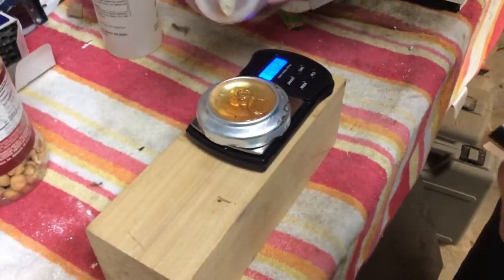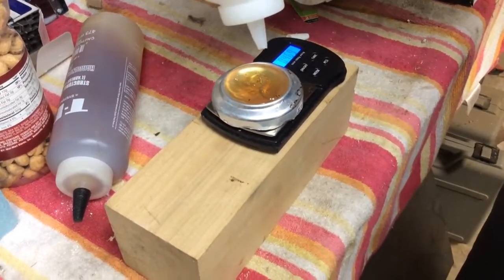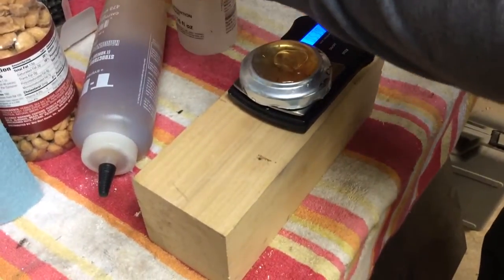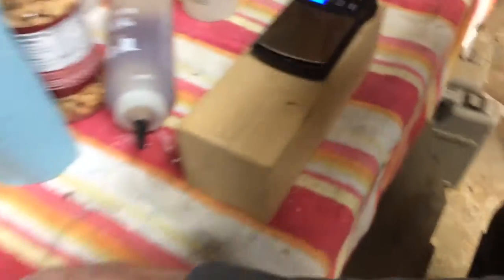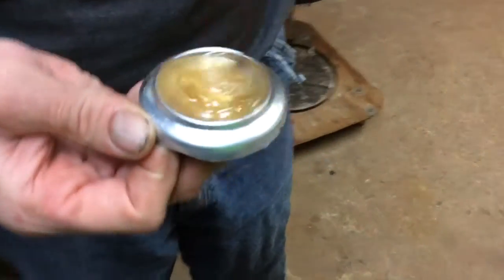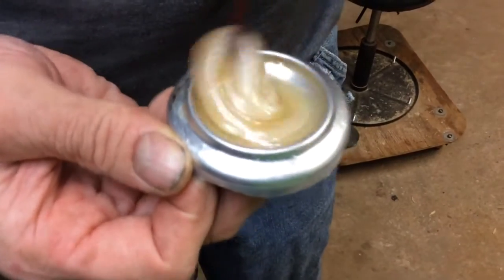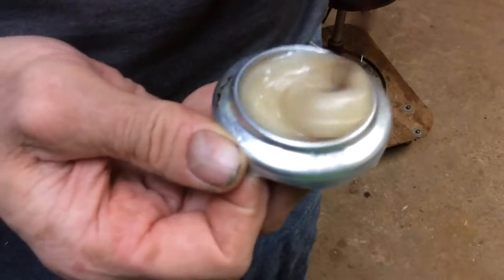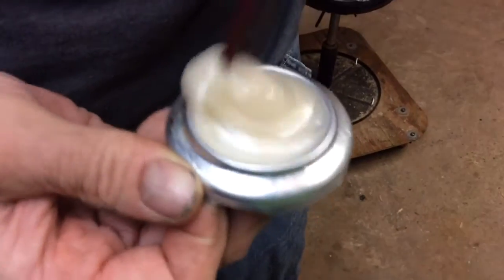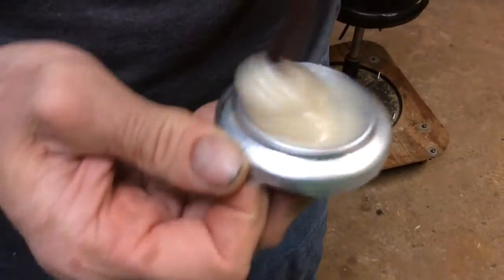That's overshot, so I've got to go back and add a little more to get us in the ballpark. We're going to take our stirring stick and start to mix this up. One of the great things about this little can bottom is that it allows you to get right up against the edges and draw down any unmixed glue. You'll notice part A was a clear color and part B was more of an amber color — we want to mix until we have a homogenous color, very thoroughly, to get the best adhesion and strength properties.